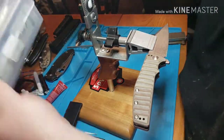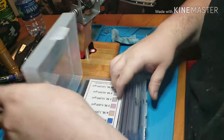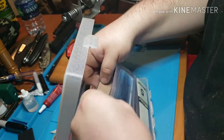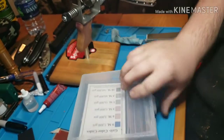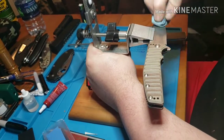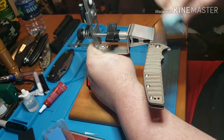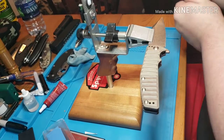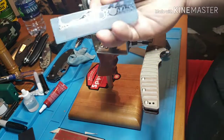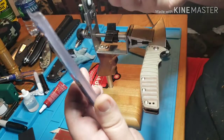I've got my lapping films here. I'm going to clean the 300 grit pieces off — any diamond particulates or whatever has come off the blade or the stone during refinement — so when I go to put my lapping film on there it's not contaminated with different grit sizes. This is what they look like: they're just glass slates with little abrasive strips you put on.